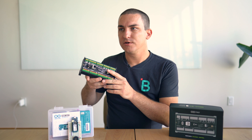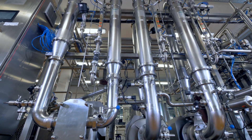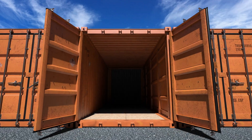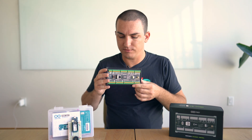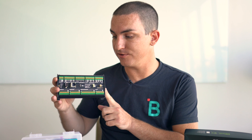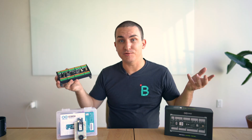This is really for OEMs. Say you make a water treatment skid based out of a shipping container and you make a hundred of these a year — maybe for the oil and gas industry. This would be a perfect product for that because it meets the price point and it speaks the Industrial Internet of Things protocols. It has an MQTT driver from the Arduino folks, but it also has several open source drivers. What I like about that is that it gives us the opportunity as a community to develop MQTT with Sparkplug B formatted payloads, and what we like about that is the interoperability with other industrial platforms.